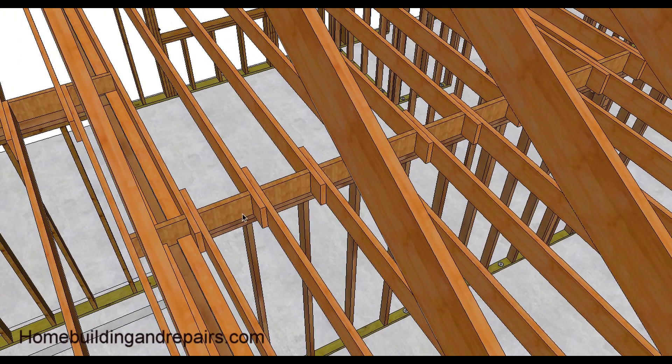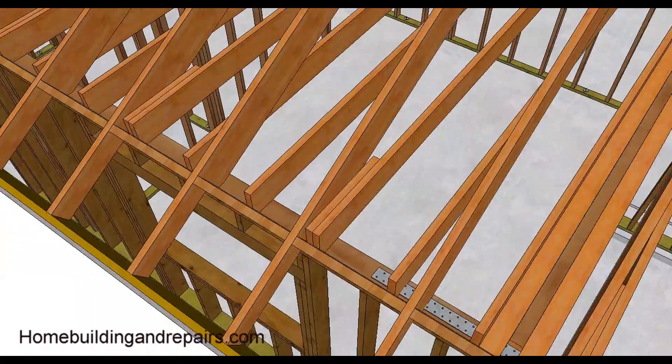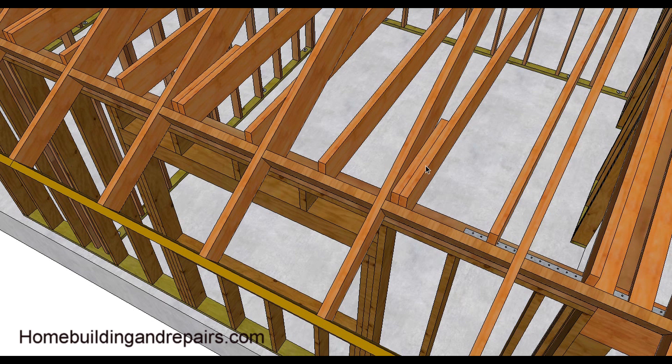They will need to lap — they don't have to, this is just one way of doing it. I like doing it like this; it gives it a nice solid connection, a nice tie across. Now, the one thing is — when you do the math — these rafters are not going to line up. You're going to have to put some type of a spacer block, whether it's at the rafter and ceiling joist at one end or in the center where the wall laps. In order to have this work out and have your rafters line up, you can move the ceiling joist and rafters over, but then you have a problem tying the rafters together at the top with collar ties or straps. So a block here and a block here is another way to do it.